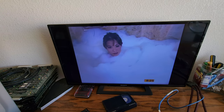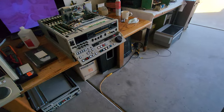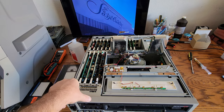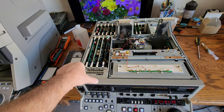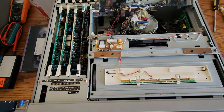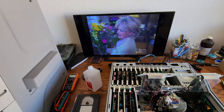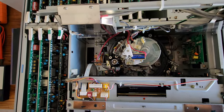You can see the playback on this BVW70 is awesome, just like the other one — just like the BVW75 that I serviced for a customer who's getting that soon. We do work on these. I know these machines very, very well. To the average person, I would not recommend trying to do this if you're not electronically inclined and know what you're doing, because you will absolutely get lost or end up causing damage. If these mechanisms are off at all, you'll destroy your tapes or you can destroy the swing arm if it goes in the wrong position at the wrong time. You have to make sure the alignments are done properly — it's very, very important.